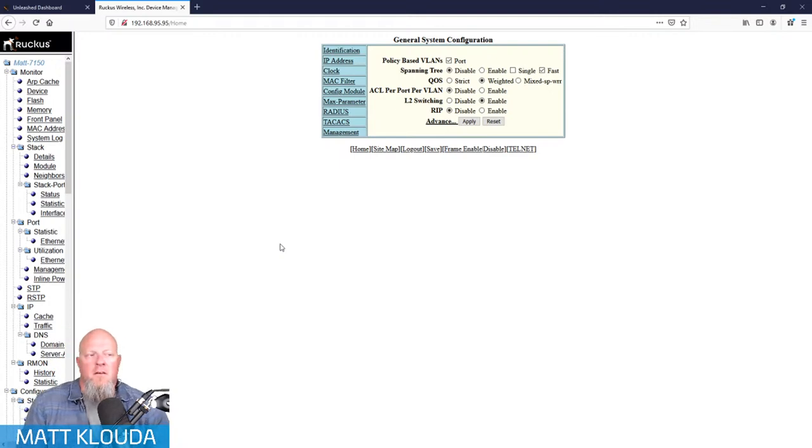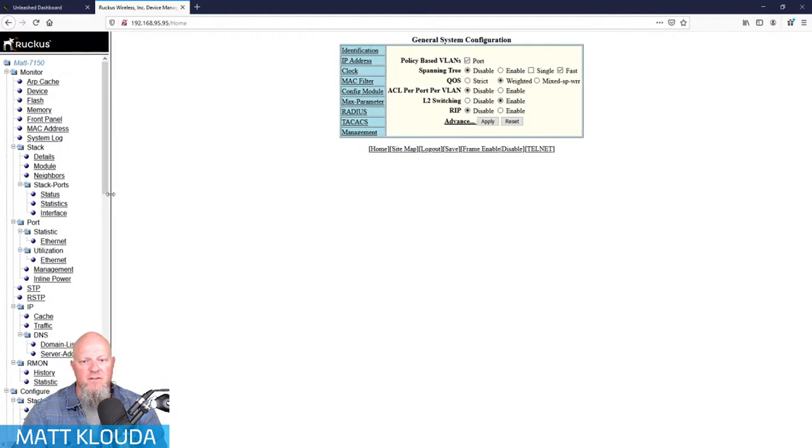Pretty fancy. Now, the coolest thing about this is you can turn power on to your ports if you need to. So the number one problem that we've seen with homeowners is the ICX is installed, power's turned on to the ports, the APs are plugged in, everything comes up, and then you take a power hit. And the power comes back on, everything comes back on except for your access points. And that's because the configuration that had to be made on the ICX to provide power to the access points was lost. And it's unfortunate, but this will help you recover that in the future.